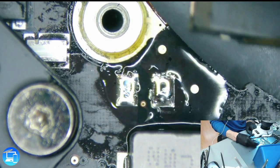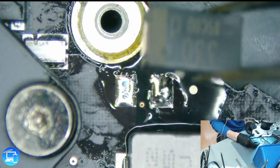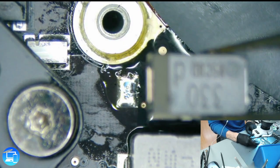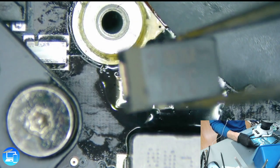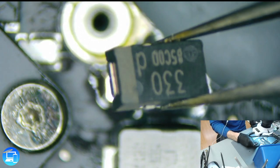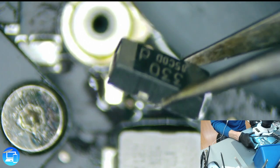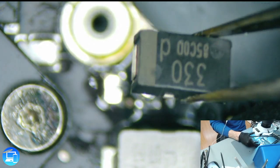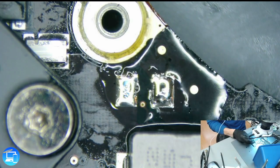It is a massive capacitor. In the past we would scratch off the logic board surface, but we don't have to do that anymore because we have these fancy capacitors — I think they're Panasonic. The tip right next to the line is going to be our positive. That side is going to be our negative or ground, and this side here is also ground or negative. We can use that as a guide for lining this up.